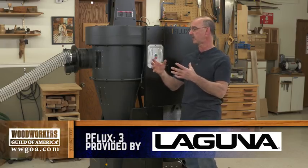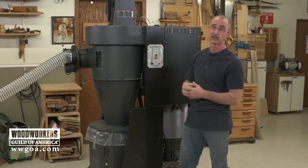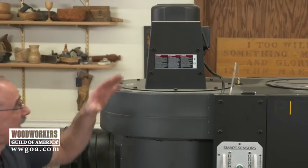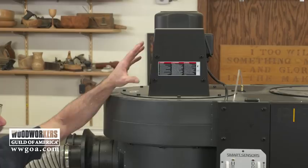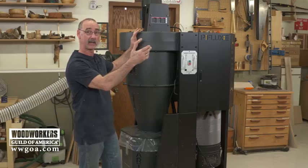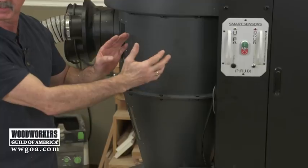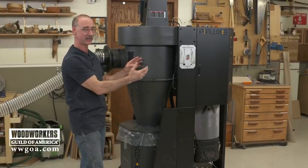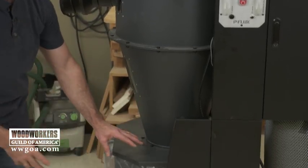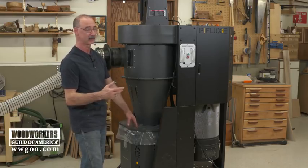Let's start out first with a 50,000 foot view of how cyclones work. Then we'll come back and drill down a little bit to get some of those benefits. So here's what we've got cooking. Up here on top of the unit is a motor that drives an impeller or fan. That fan is going to spin, and that of course is what's drawing air into the unit. Below that impeller, we've got this funnel-shaped device, and that's where the cyclonic magic starts to happen. This is where debris falls out of the airstream and ends up in a barrel, a collection point down below. We're going to come back and look again at this barrel in just a little bit.